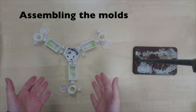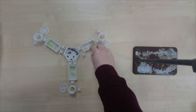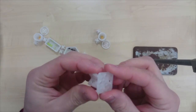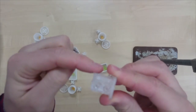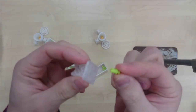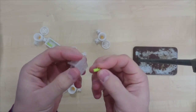To make the parts, we need molds, and in those molds, we will inject some silicone. The idea is you will have these small parts that will be inserted inside the mold. Some silicone will wrap this part, and this part will still be accessible to punch some of this tiny part from robotics that will adapt to the motors.